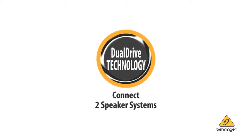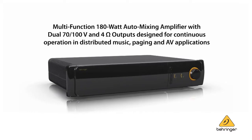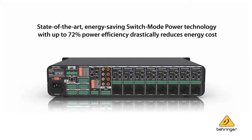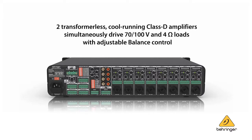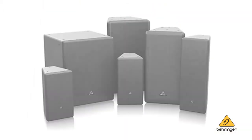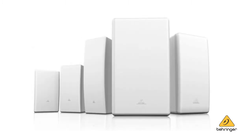The powered versions of the MA6000 series include dual drive amplification technology. Dual drive amplification technology is, in fact, 2 distinct separate amplifier channels. The intent here is that you would use the high impedance output, the 70 or 100 volt output, to drive distributed speakers. And you could use the low impedance output to directly drive a passive subwoofer, or a series of passive subwoofers, or even a high performance pair of speakers all the way down to a 4-ohm load that would give you an opportunity to deliver higher performance sound in certain parts of the venue, and of course the utility of distributed speakers in the rest of the facility. EUROCOM offers a wide range of speakers, from ceiling speakers, installation speakers, wall mounting small two-way speakers, both in low impedance and 70 volt format, that pair perfectly with the MA6000.